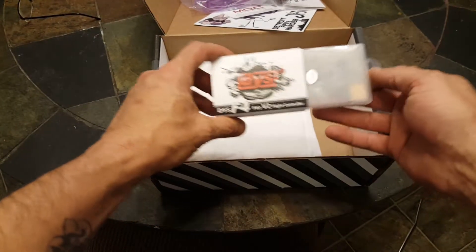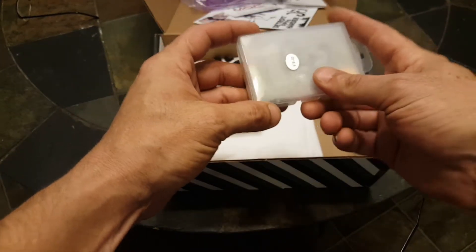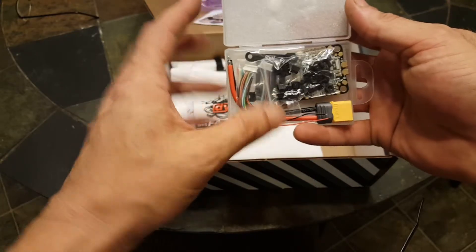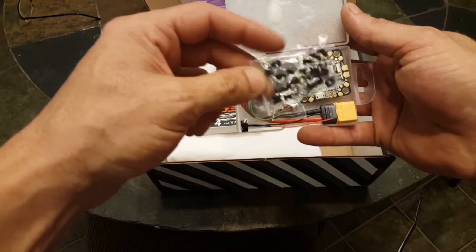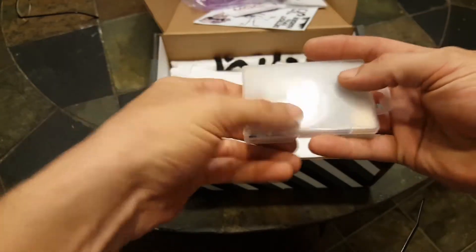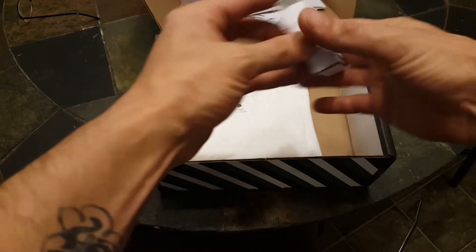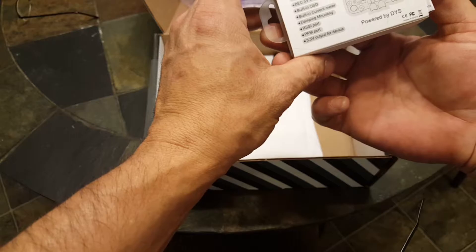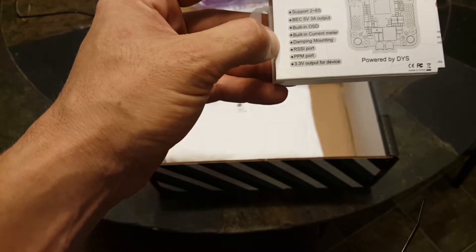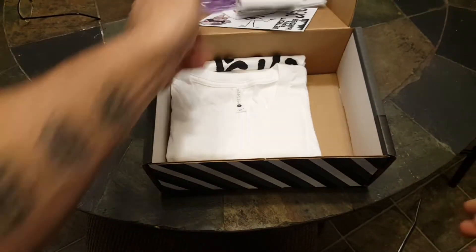This month's boost item is the Pro V2 flight controller. Nice lead and everything. Got a top protector board, all of your standoff hardware and rubber insulators. Nice item. Who doesn't need a flight controller, especially a DYS? 3-6s, built-in OSD, current meter, RSSI, PPM, 3.3 output. Very nice.